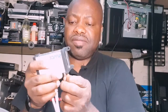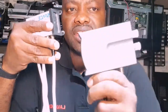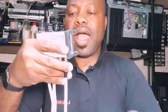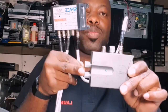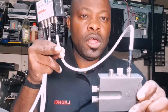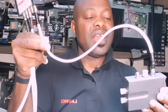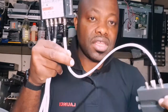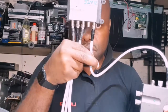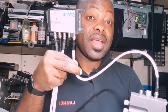The splitter box has one input and four outputs. You take the picture signal from the amplifier box output into this splitter. That splits it to four television connections. Since each of your three decoders already has a television next to it, that gives three TVs. You then buy a second splitter box on the same line for another four outputs, giving you eight extension points total from the splitter boxes.